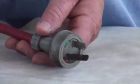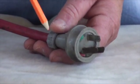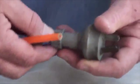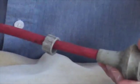This is a typical male plug top where the prongs are slightly crooked with no insulation on the active or neutral. The rim is okay; however, the collar is split. This means that it is loose and will come away from the plug top itself.